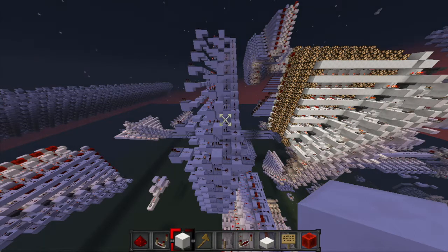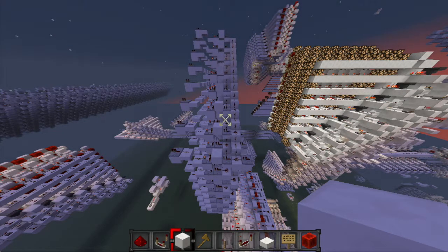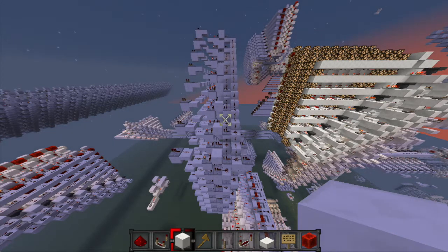This is going to be useful for the design we are using, because we can use the first design to do all of the shifting from more than one place value, and then add more bit shifters to do the remaining work. Effectively, we are shifting the work from the main device onto another device. So since the first circuit is no longer doing all of the work, we can get rid of some of the comparators so that we have room to place control wires.